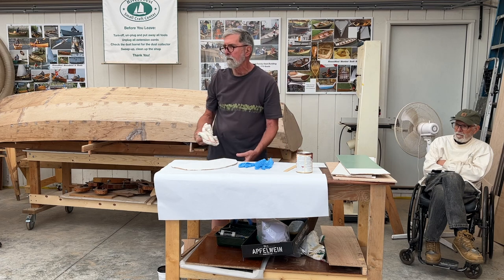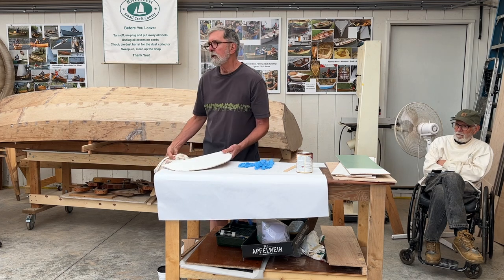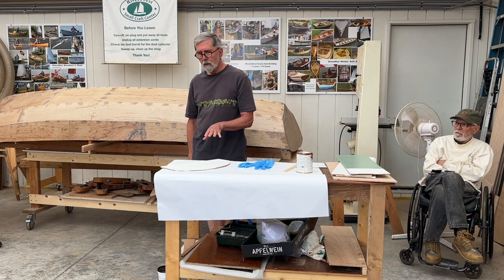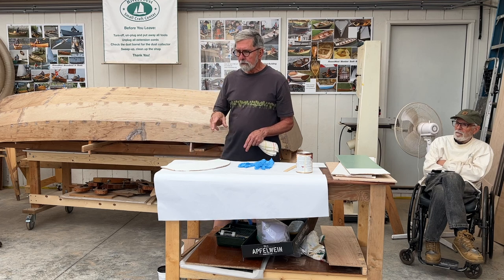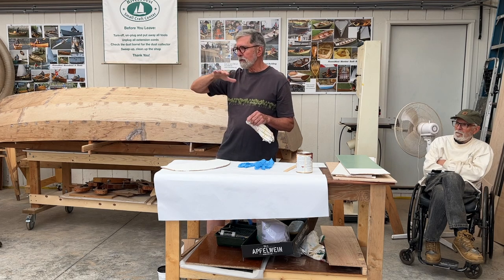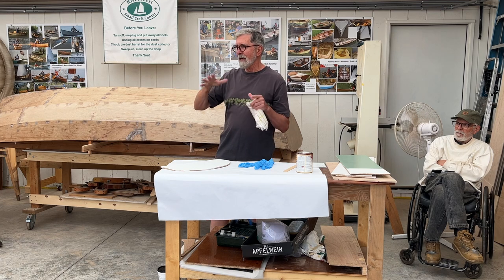What is the ultimate purpose of sanding, other than a smooth finish between layers? The primary purpose is to give the surface a little bit of tooth. Also, no matter how you apply it — brush, roll, or roll and tip — you will end up with surface irregularities that carry through to the finish coat. Any time you can take those out, it's a good idea.